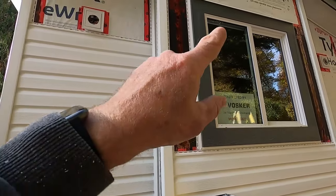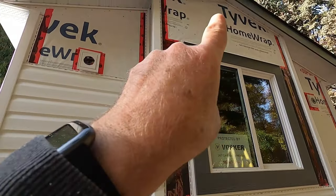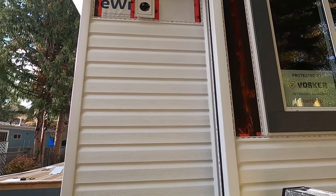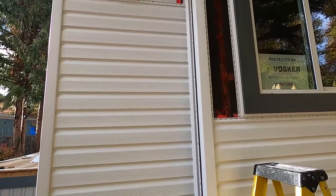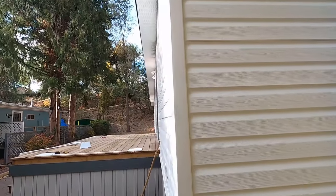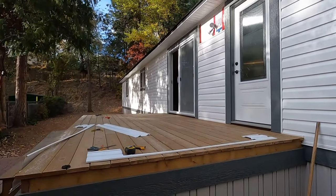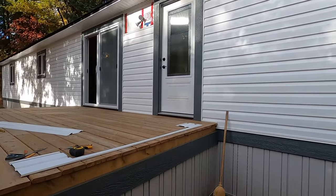There's J trim along the bottom, J trim along the top — there's a lot of J trim that has to be installed. Then you terminate up there with a piece of sill trim. Sill trim you also use on the bottom of your windows — it's sort of a U-shape thing. Your siding pokes up in there and it conceals the cut edge of your siding and holds it. Once you get all your corners and the J trim and everything — you can see the J trim up along the eave there as well — then you start putting siding on. I've kind of got ahead of myself here. This is all done on this side, the other end is all done, so I'm just going to finish it up now.